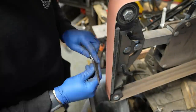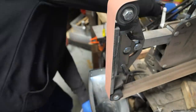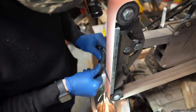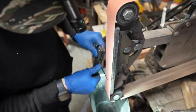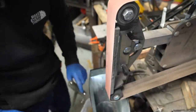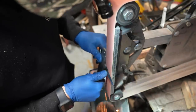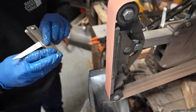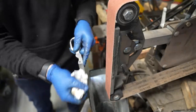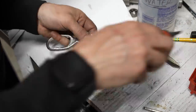Now that the rough shaping was done, I could start to grind in the bevels on the scissor halves. I was going to make a jig for this, but I figured I would try my hand at freehand grinding them — it took a little bit of practice to get the bevel correctly, but once I did it came out really nice. This dramatically reduced the weight of each side, and after messing with them and feeling them once they were ground, I really noticed how much more nimble and delicate they felt. I used that grind guard just so that I wouldn't go beyond my plunge line. I also had to be very cautious about ruining my temper, so I quenched as soon as the pieces got hot, and I'm wearing rubber gloves so I can feel the heat as I'm grinding in those bevels.